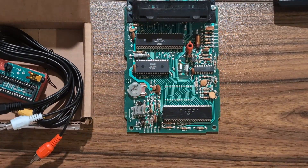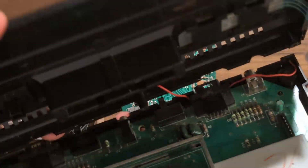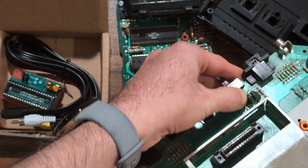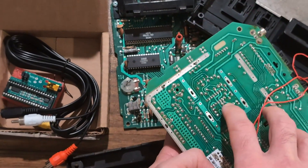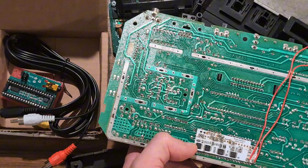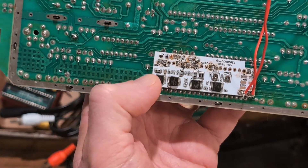There are a lot of mods out there that require soldering. I got this abomination from eBay where they basically soldered directly on the board without even putting in extra circuitry, and that didn't work. Then there's soldering to TP5, the luma/chroma output from the chip, but that creates a very weak signal you can barely see. Then I got this 'clean comp' board — that's another option if you can solder, but apparently my eyes and hands at age 50 are starting to fail, and I failed miserably.